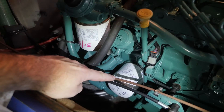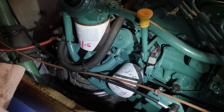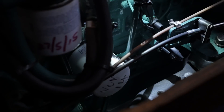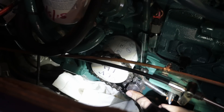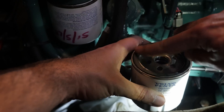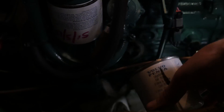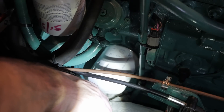That's the oil filter down there. I've heard from some people that use a screwdriver or another sharp object to poke a hole in the oil filter to help drain the last of the oil. I usually just throw some paper towel underneath the oil filter. They're usually on there pretty good - but just like in real life, there aren't a lot of issues about a boat that can't be solved with a bit of bike chain. Now we just need to lubricate the seal on the new filter with a bit of oil. There's no need to over tighten an oil filter - just tighten it until it's got good contact and then tighten it another half turn. No more.